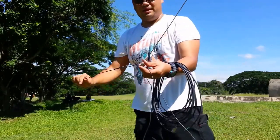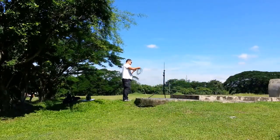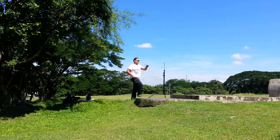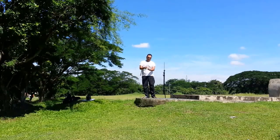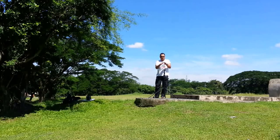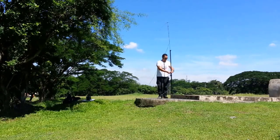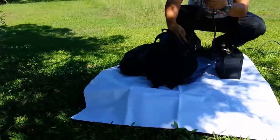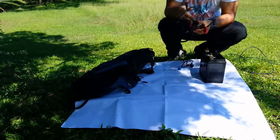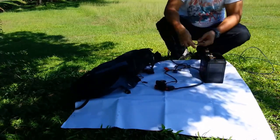The main element is slightly shorter than 19 inches — I measured the SWR rather than relying on the internet's standard recommendation of 19.5 inches. I put a half-inch curtain rod inside the light stand to extend the height; the rod is around five feet long and the light stand is nine feet high, for a total of around 14 feet. Here I am attaching my DIY power distribution box to the battery using regular car battery terminals.